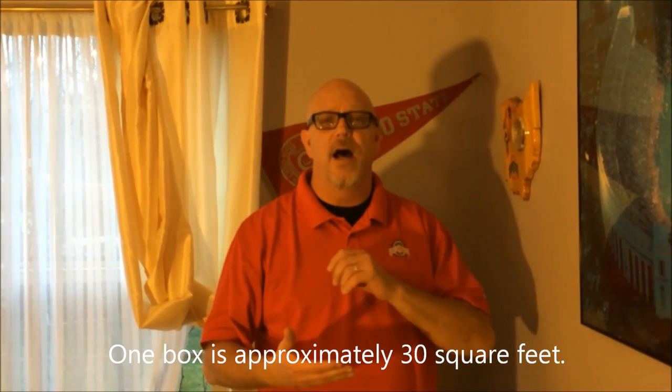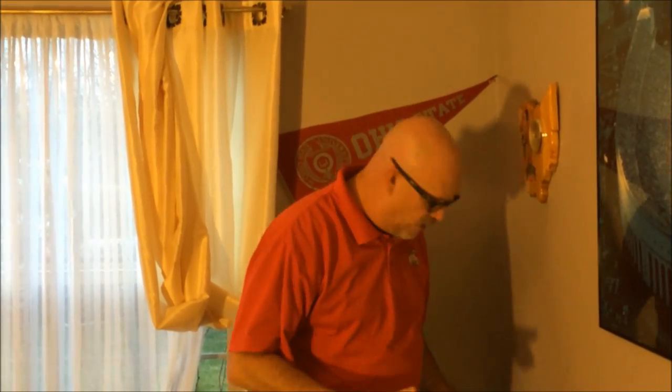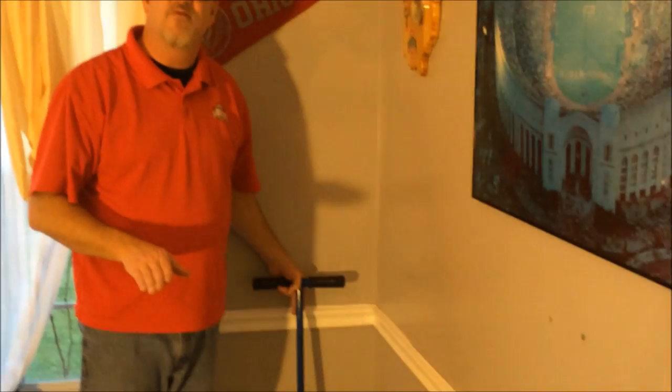As a finishing touch, we also need to roll the floor. I rolled more frequently than just right now — this is going to be a final roll. I rolled about every 45 minutes to an hour. When laying it by myself, I went through one box in approximately 50 minutes; that included cutting where necessary, spraying and laying, and then rolling over top. So you want to be rolling this stuff about every 45 minutes to an hour. I've got a pivot handle, so I like to go down and then come back at a smaller angle, back and forth several times so that I'm hitting each seam three or four times. I also like to go the other direction — my reasoning is I've got seams going in both directions, so I might as well roll in both directions as well.